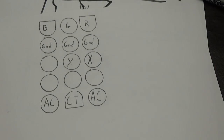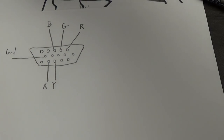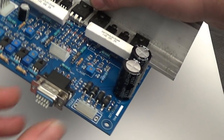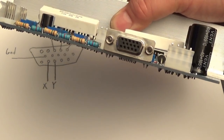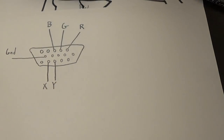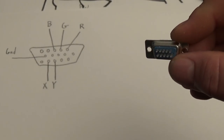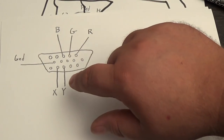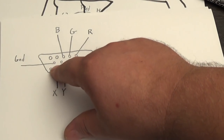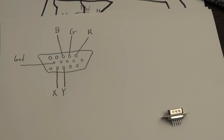We'll get back to how to wire it into the board. This board that Fred made has a 15-pin VGA connector. This is the pinout of that 15-pin connector. You're going to get this connector in the kit. You're going to want to solder onto these pins in this order: red, green, blue, X, Y, and ground. I chose just to use one ground — there are other grounds on this connector, but I don't think it's necessary to ground it multiple times.